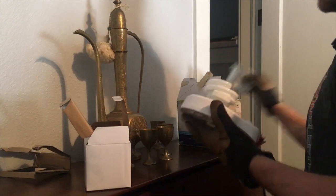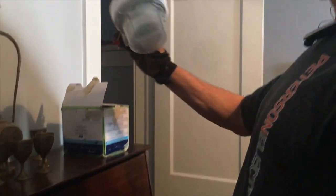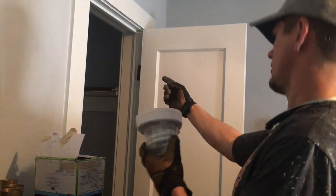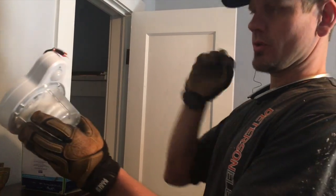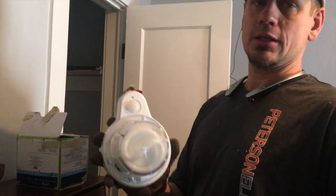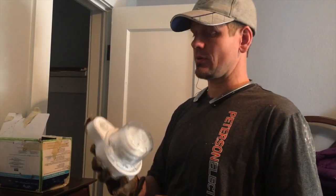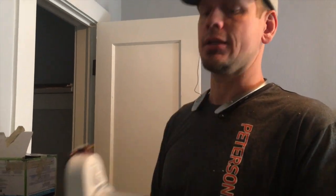What I love about this fixture is it's rated for closets, because anything below a surface mount or recess has to have a plastic lens. So I can get away with this even fairly close to shelves in a small closet. What I like is it has a motion sensor, so as you open the door it just triggers — I don't always have to reach down for a switch. Very cool. But I do need attic space; if I don't have attic space I'm cutting drywall just to get a wire through for a constant hot.